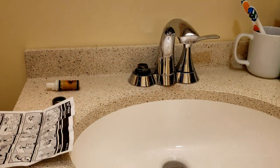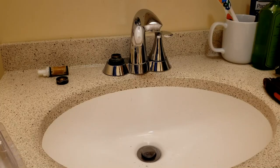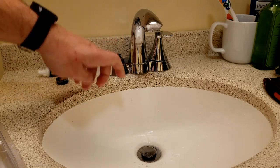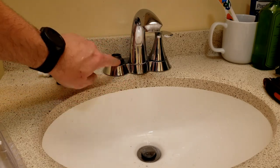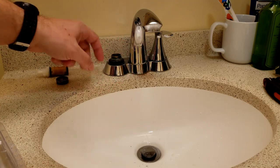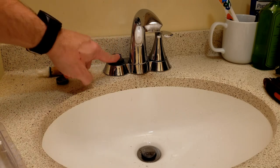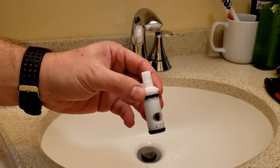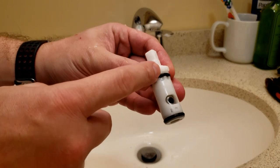I'm gonna shut off the cold water supply as well. Look — if I put my finger in, water pops up. I shut off the cold water supply; I'm not sure if cold is somehow seeping through, but that definitely prevented more water from building up in here. Next is the cartridge, and over here there's a little notch.